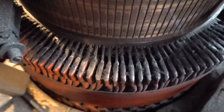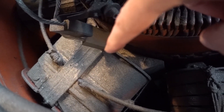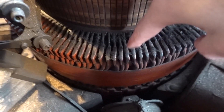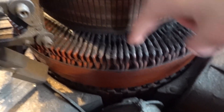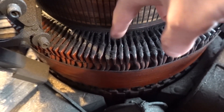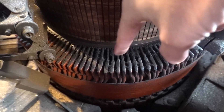I'm going to break it down for you. What we do is we take windings, which are electromagnets — think of it like a transformer. That's one core and coil. We have that winding generating an electromagnetic field, and then inside that electromagnetic field, we move other windings — pieces of copper and iron. When you move a coil inside an electromagnetic field, you induce a current in that coil. You turn mechanical energy into electrical energy. It's a generator.